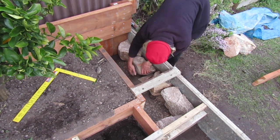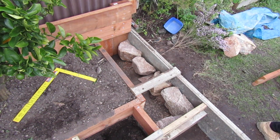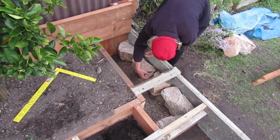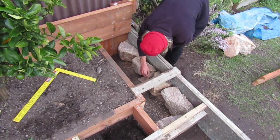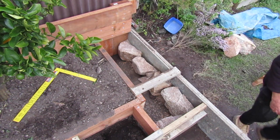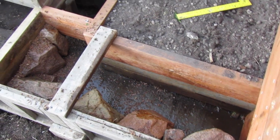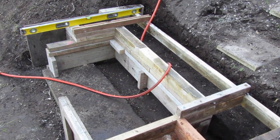I've selected cube-shaped stones that are all roughly the same height to get the bottom of this wall started. But because the stones never fit perfectly together, I'm adding a couple of smaller stones to fill the gaps. I always take my time with this process, as these stones are going to be exposed in the final product, and they have to look good as well as being strong. After adding gravel chips to the small gaps, this completes this section of our wall.